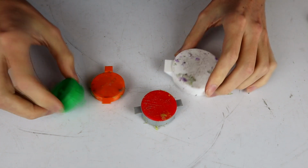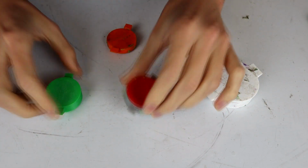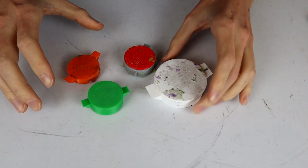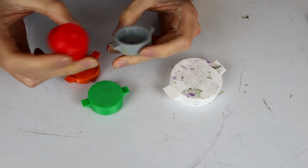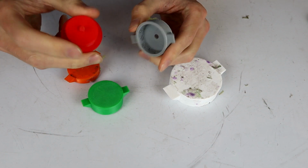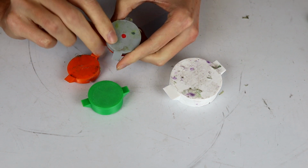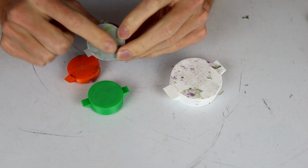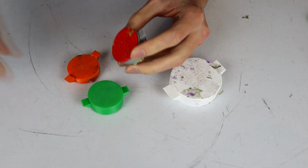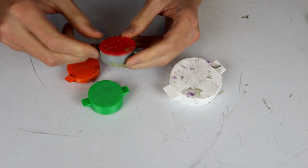So these are the molds that I have been using, and there are files for these on Thingiverse, well, at least for that one, I think. These are all customized versions of the same idea. They are a 2-part mold, which means they have an outer mold, an inner mold, and then I've also got this little locking lug that centers down and through the whole mold so that it centers up and the cast comes out symmetrical and concentric and all of that kind of stuff.